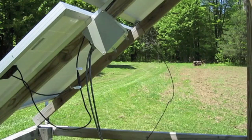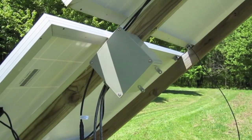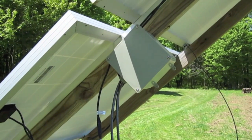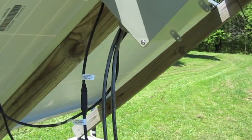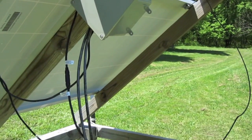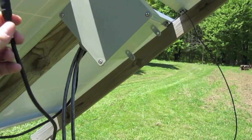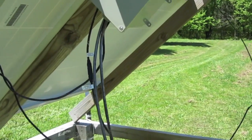I have a combiner box that I built with a Home Depot box and two bus bars. I believe I have a picture of it in the solar electric section of the website. I ended up cutting off the ends of the cables — these connectors — so I was able to get bare wire. The two panels are connected together right here, so it acts kind of like one big panel.